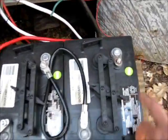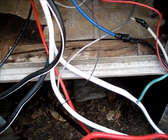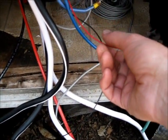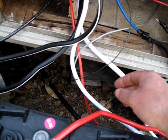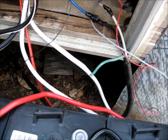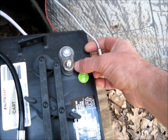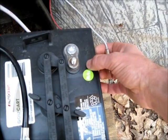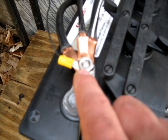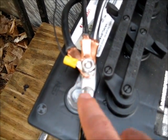Here's my battery bank outside. I have the main positive off so I can do the wiring. This is a crazy amount of wires coming through here. There are my new battery voltage sense wires, and I also have to mount my temperature sensor on here. I'm going to need a main bus terminal because this is too small to hold all my wires now — I can't even screw that nut down all the way on the negative terminal because of all the connections coming out.